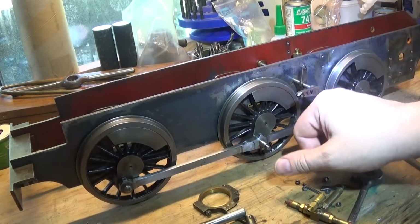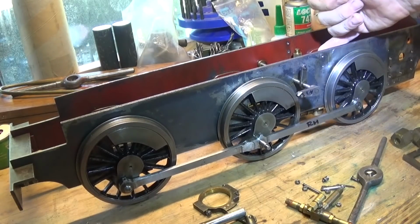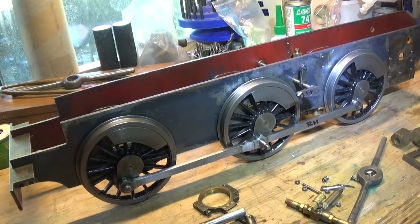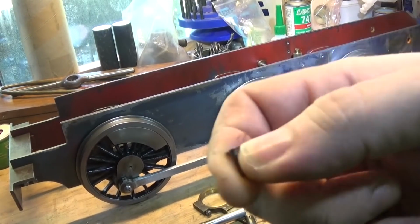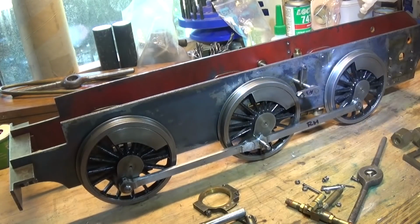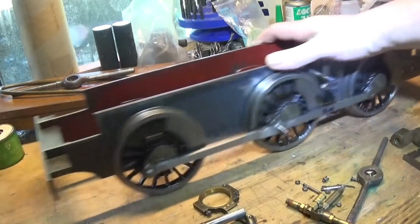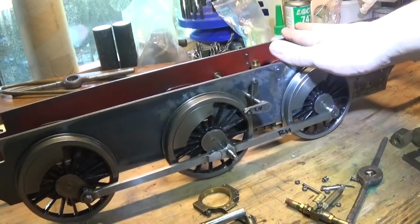These two were 1/8 Whitworth, I think. And what I've done is drilled these, a little bit braver drilling them through for the full length of a 5BA screw, and tapped them out and put these in. They went in nice and tight, and they're in there now with a bit of Loctite. They're not coming out again, and I'm really pleased with the way that goes.